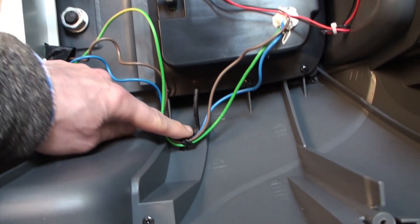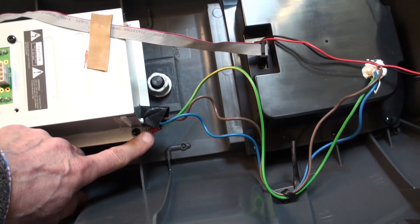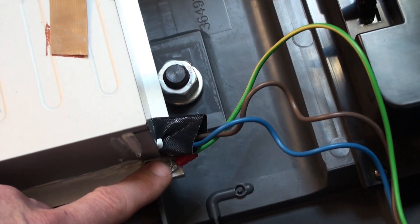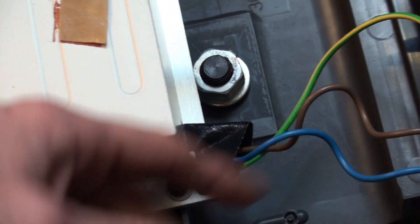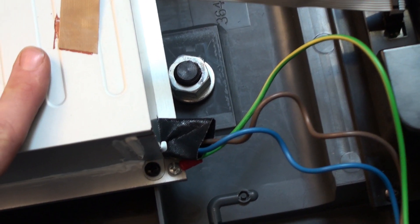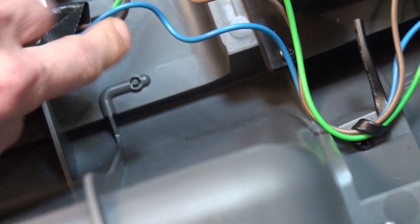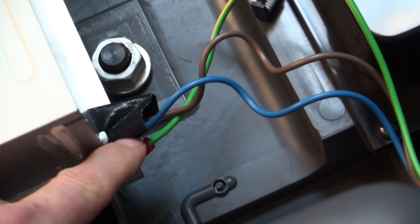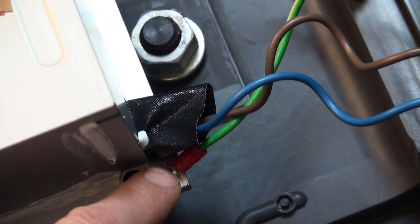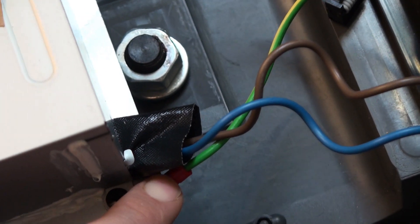You've got the mains wiring coming out, secured down here by a clip to the casing, then going on three separate wires - all different lengths. Note the earth wire that goes on the corner of the aluminium - it must be fitted. Otherwise, if there's a short and the power supply breaks down, instead of blowing the fuse or tripping your residual current circuit breaker, it could present live wires onto the back of the unit. They use these awful crimps which don't have stress relief for the sleeving - anyone making safety-critical equipment would never just crimp onto the conductor without extended support for the insulation.